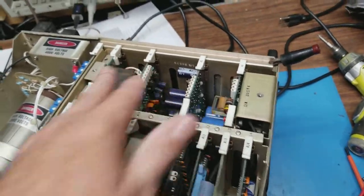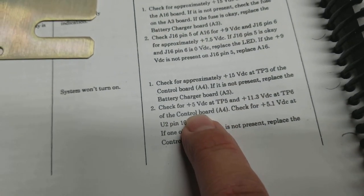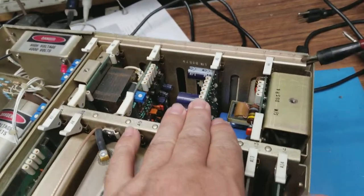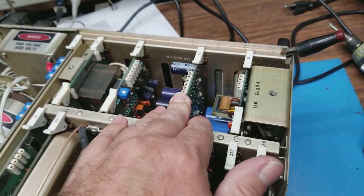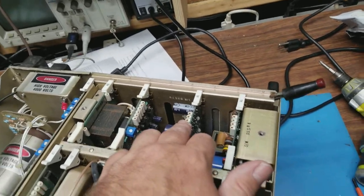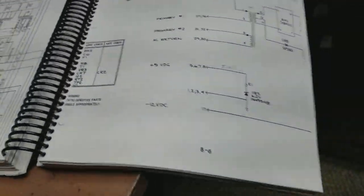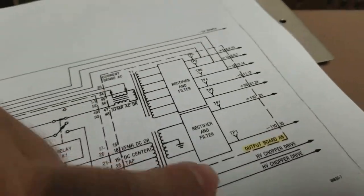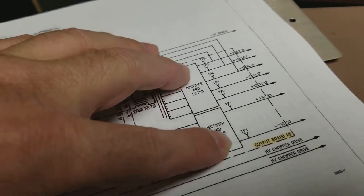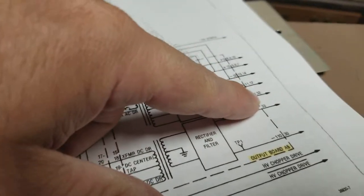I've checked A4 and I have all the proper voltages — 15 volts at test point 0.3, 5 volts — all those values are present. When I go to the output board A5 and check for shorts to ground, everything is fine except for pin test point 0.3, where I get 0.4 ohms or less to ground. Accounting for lead resistance, that's an absolute dead short on test point 0.3. The output board has a chopping transformer, rectifiers, filters, and Schottky fast-recovery diodes. Test point 0.3 should be plus 12 volts.